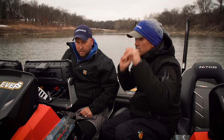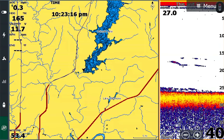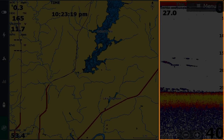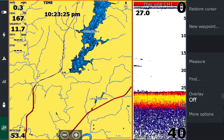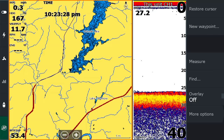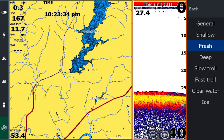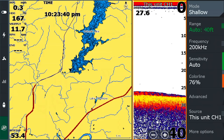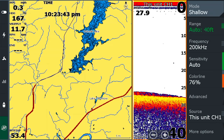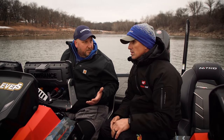Is there anything we need to do to set up that sonar? In the past we've always set the sonar into shallow water mode. I touched the sonar box and you can see this little orange ring popped up around that screen — that means when I touch the menu now, I'm going to have my sonar options. Whatever screen you're trying to adjust, make sure that orange box is around it. We're going to set this to Shallow mode. Basically what that does is it tells the unit not to search out to a thousand feet — shallow mode is zero to 100 feet, which is what you're fishing most of the time.